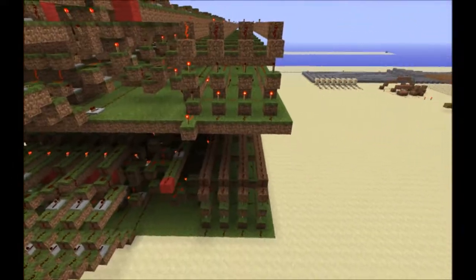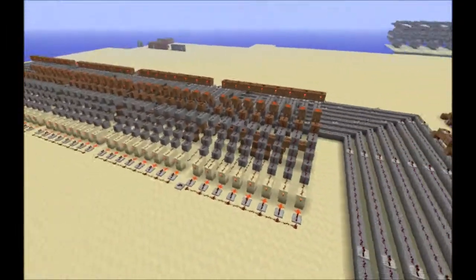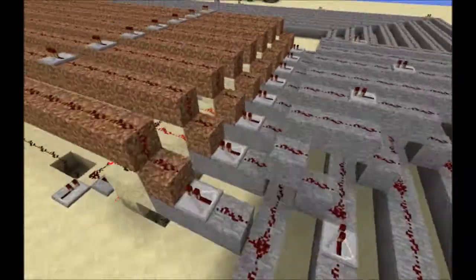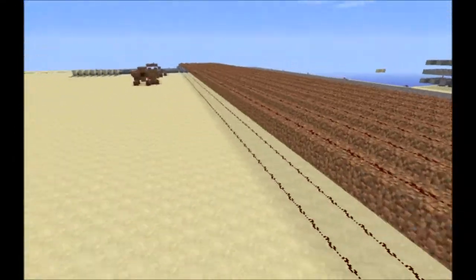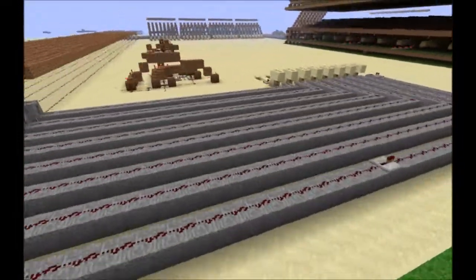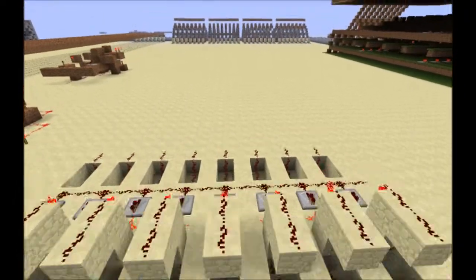Here are the address selectors. They'll be hooked up together and put into an 8-bit bus. As you can see, we've got buses running along all the way over here. Here's another register right here, which is going to store the ALU calculation, and this long bus is where the ALU will be. This is the main bus. When I finish this, it'll be color-coded. And this right here is the instruction address register that will control all of this.